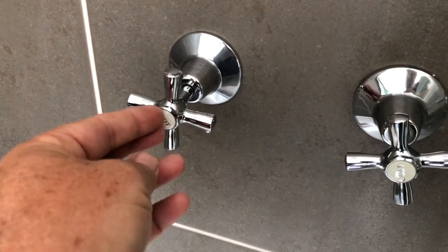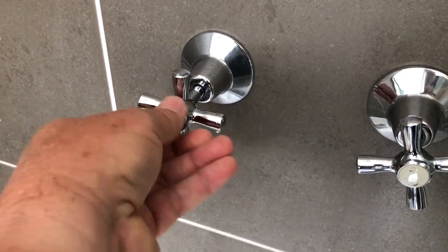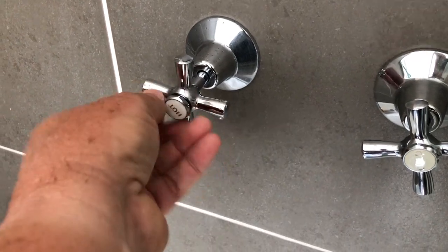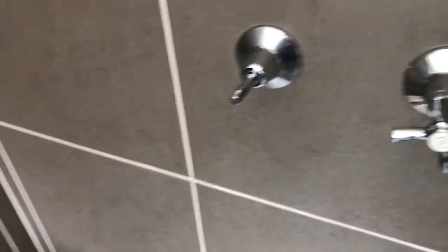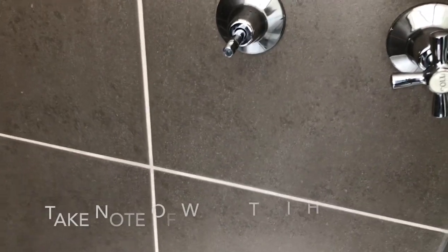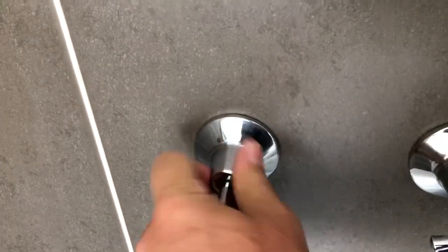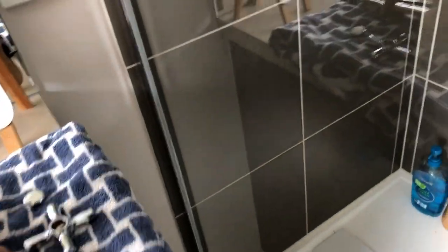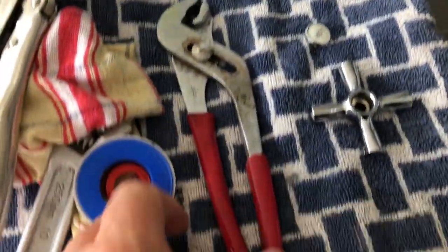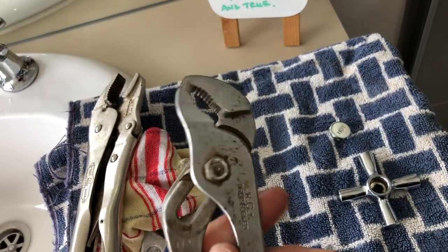Number two, we're going to pull these apart. Often you don't actually even need a spanner - these are little lock nuts on the top, be them red dots, blue dots, hot or cold, or whatever. That comes off and then the next section underneath spins off as well. If they're tight, a pair of slip joint pliers is an excellent tool for plumbing. I'll put a link in the description to find some tap washers and different tools.